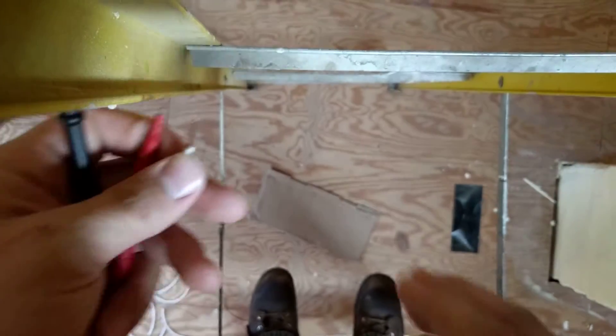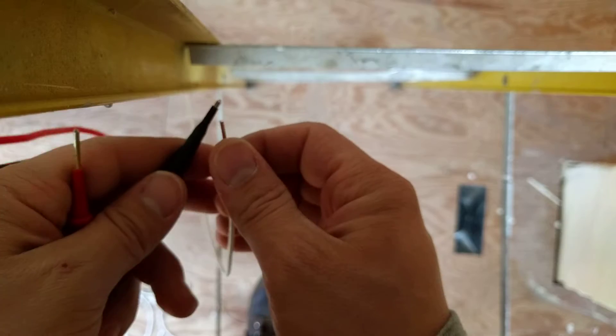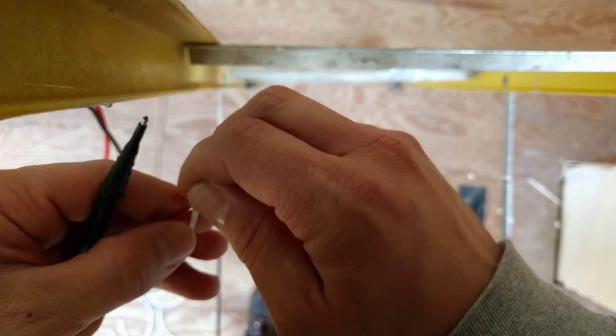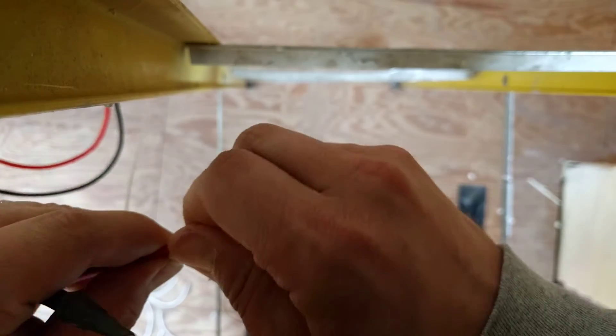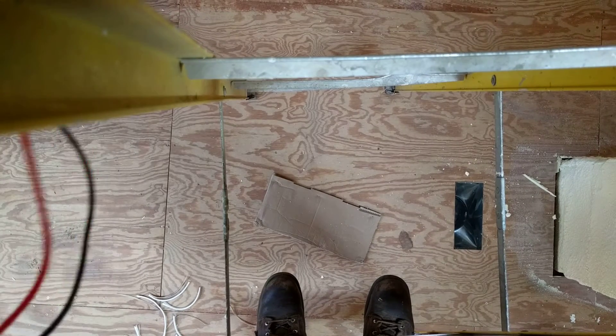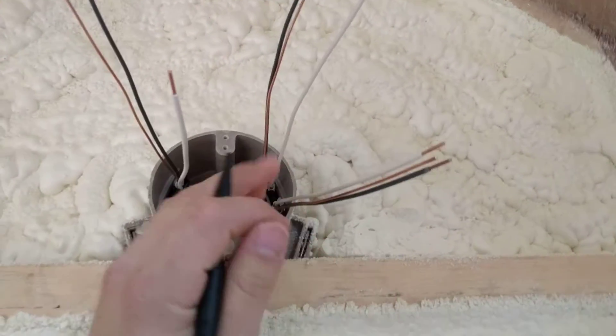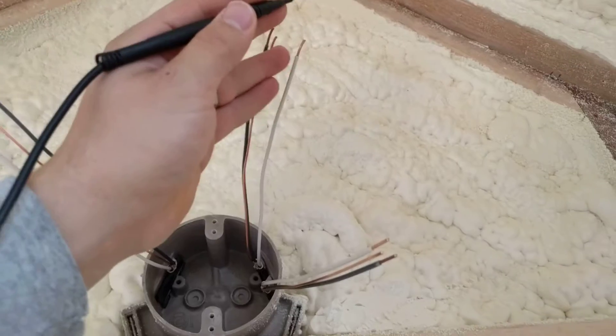It's going to be interesting — I don't know if I can do this with one hand. What I'll do is take this cap off of here and wrap this around. Okay, so the connection is good — it's just hanging on there. Up here, it's either going to be this set or this set. I know that this set is coming from over there, so there shouldn't be continuity there. So I'm kind of guessing it'd be this one — we'll see if we're right.